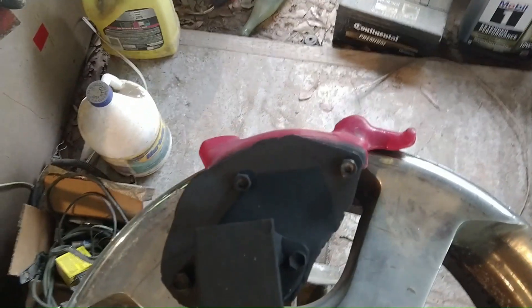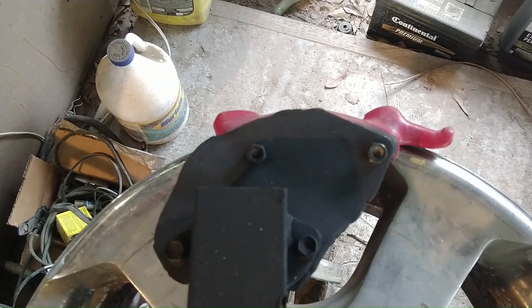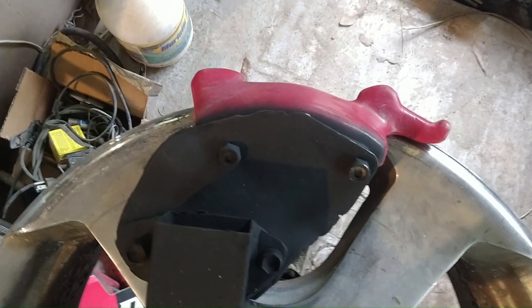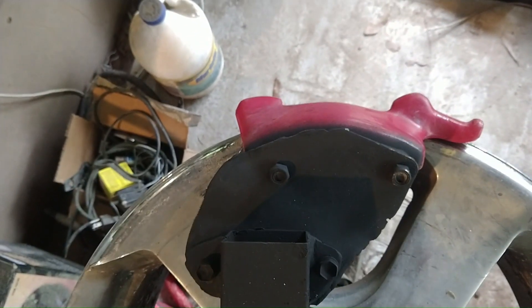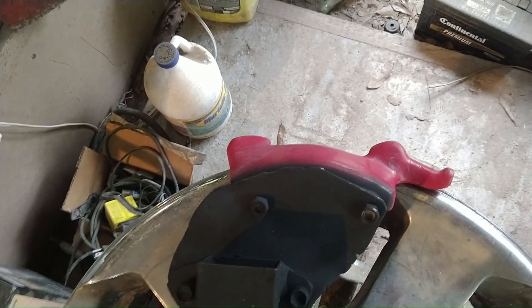How your duck bill sets, you've just got to fit it. You've got to fit the duck bill to your little piece of plate steel. And if you mess up, just get a new piece of plate steel. It doesn't need to be centered — it needs to be to the right of center. I'm doing mostly 16s, so with 16s this works well. If you're going to be doing 20s, you'll want to fit it with a 20 and drill the holes for mostly 20s. You could probably do 22s or 18s. I've already done 15s and 17s, but I haven't done 18.